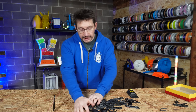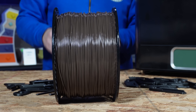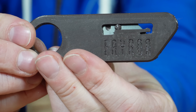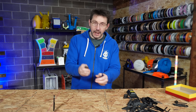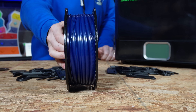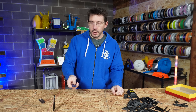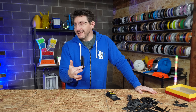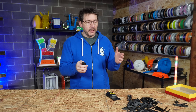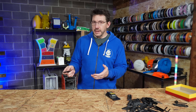You might be asking if carbon fiber nylon is required — it's not. I also used recycled PETG from Prusa on the Pantheon machine, but the little posts didn't want to stay and it chipped out; it'll lock but won't lock back. I also tried ASA — it's a little too flexible and hard to push out, though it locks in just fine. PLA, ASA, PETG, and CF variants of nylons are all valid for this. The Sunlu E2 did a fantastic job keeping filaments dry and at temperature across ASA, PETG, and both flavors of nylon.